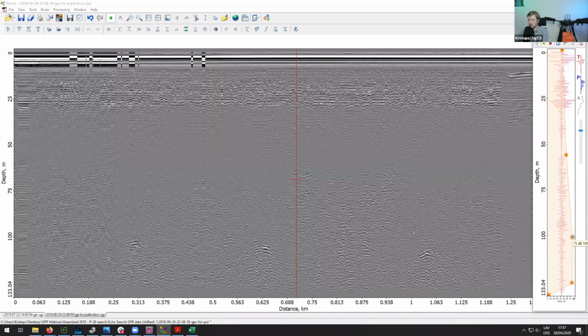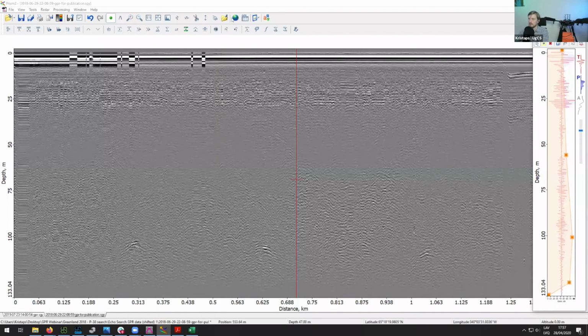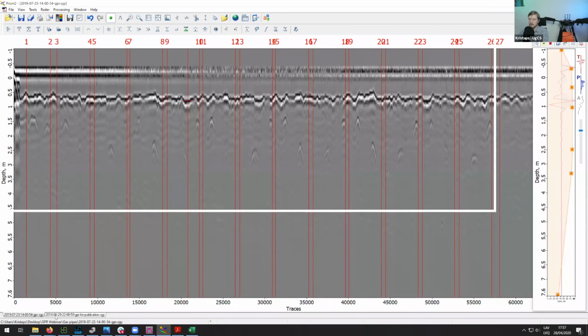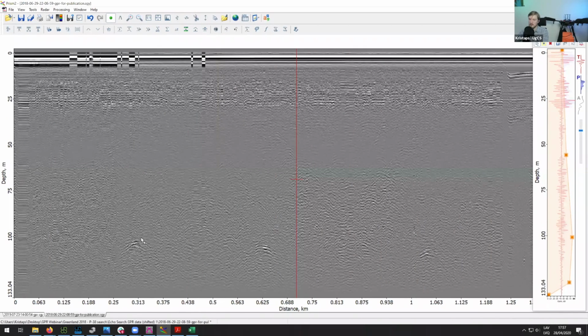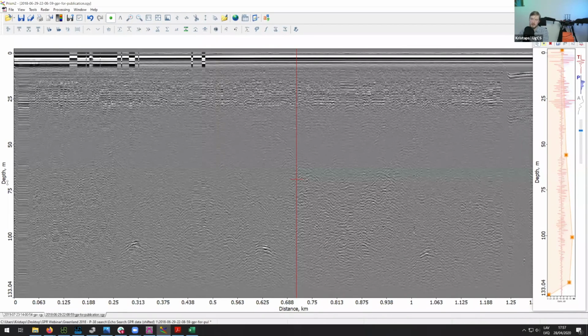And so if you expand this region at the very bottom, then you can actually see that there is something here. So let's open up the GPS trace. I think some are missing over here. Yeah, in any case, here you can see on all three of these survey lines, you are getting some anomaly over here. And I think this data has already been processed, so the zero point has already been adjusted and the permittivity as well. Let's check that. It's not really printed here because this is a bit of older data. But basically here on the side, you can already see the depth.